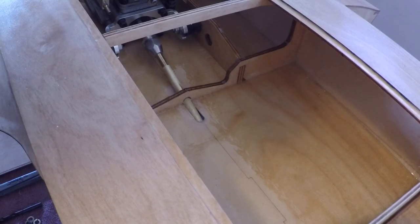As you can notice, I still have our stuffing tube positioned up through the stuffing box so that it's in alignment with our collet. I merely have it pushed up right against the collet for now, so I know my alignment is perfect. I also still have my 1/4 inch wooden dowel, which is representing my drive shaft or drive cable, whatever you'd like to refer to it as, and that's still inside the 5/16 stuffing tube. So everything is positioned really nicely, and we've got a pretty good mix of colloidal silica and epoxy here now. It's a nice thickened white mix.